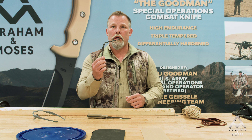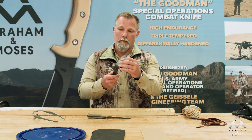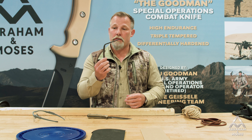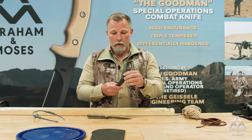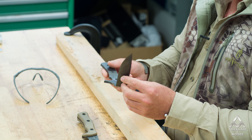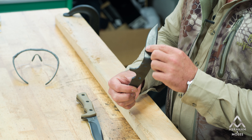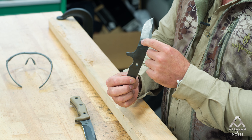This is what can be accomplished when you put all this into play with a knife. This knife was bent past 90 degrees, then left in a vise and allowed to naturally return, and then taken out of the vise. As you can see, there is no cutting edge deformation whatsoever in the bend area, no stress cracks.